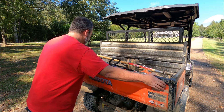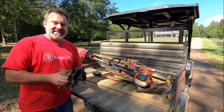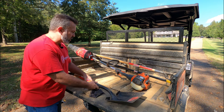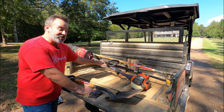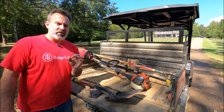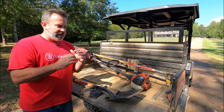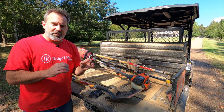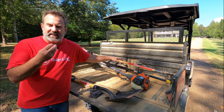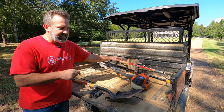More items we're going to need to do this job properly. First and foremost are some gloves — this tar-y stuff on the outside of this asphalt cold patch is nasty. I mean, you can see I already got a little bit right here just from touching the bag a second ago. A good flat headed shovel for moving the material around. A blower of some sort — you're going to see what that's for here in just a second. A broom and a fixed rake. One of the key elements to making your cold patch work is adhesion to the substrate or the material you're putting it next to, and for that to happen it has to be clean. It can work under a wet condition but it needs to be a clean condition, so we're going to use the blower and the broom to clean out these holes.